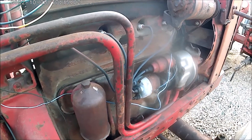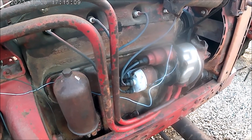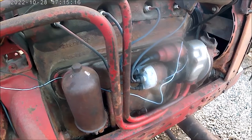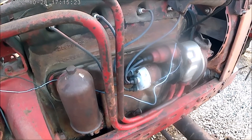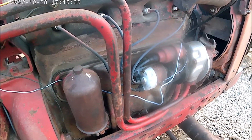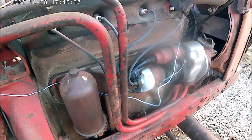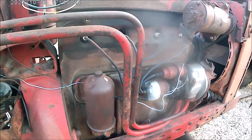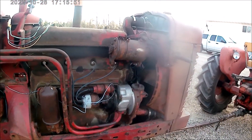Off camera last night — it's going to have to be off camera because I didn't record it properly; it showed in my screen that I had a good shot, but the footage cut off three quarters of it — I changed the points and condenser and rotor, and gapped them properly. I put this coil on, so there's no excuse why this tractor won't run now, other than putting some gas in it.